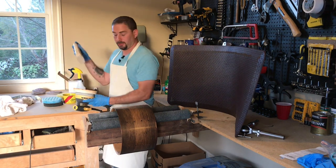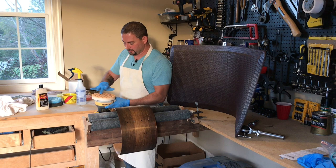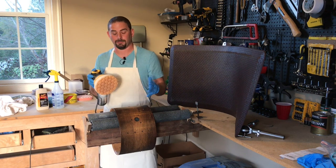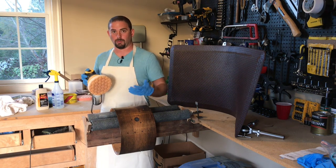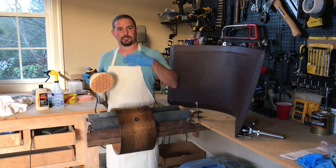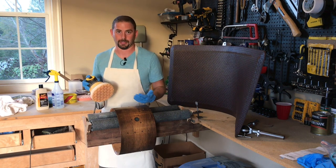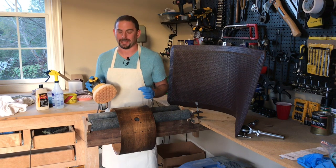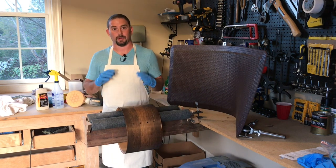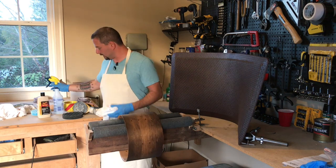Lubricate the pad, shake our cleaner, get a little swirl — not too much. I'm going to lubricate the drum very lightly. As I mentioned, do not do this and then expect to add a coat of polyurethane later if you mess it up, because even if you think you washed off all that water and dried it, the next coat of polyurethane will have little round beads — circles spotted all over your finish inside that layer of poly — and it'll really make a mess, then you're going to have to sand that all away and start over. I know this because I did it. Same thing — we're going to wait for this to cool down and then wipe it off. Now I'm going to take my medium rag, give it a little bit of water, and take this medium finish off.